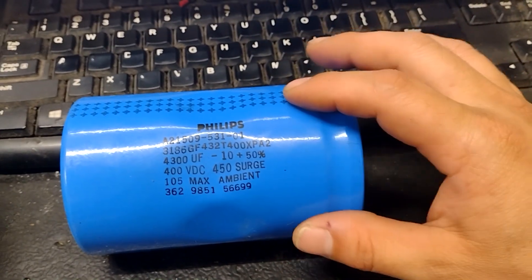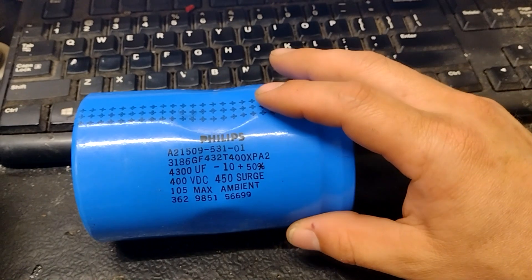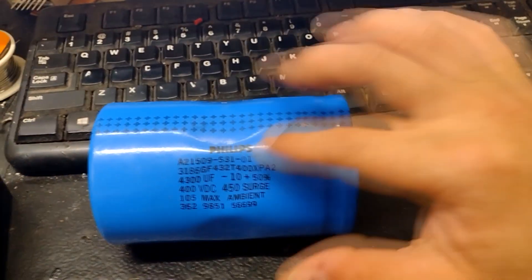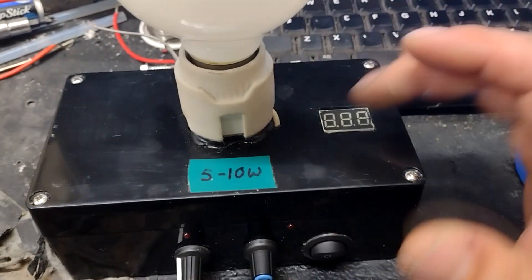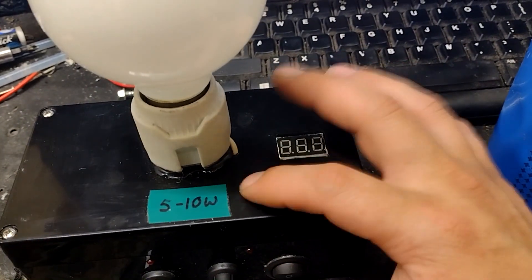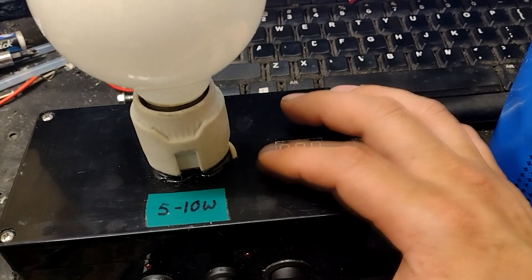Through that process, however you do it — whether slow or fast — simple quick charging through a ZVS just makes sense, especially if you can slow the rate or set an output voltage and let it sit there. The reformer is basically based on a circuit just like this, which is a ZVS driver. The only difference is this one is a limited ZVS driver, only using a buck driver.